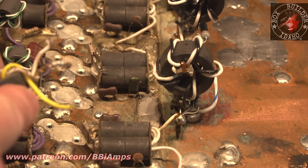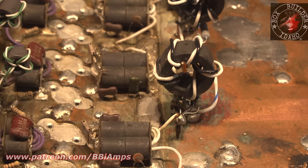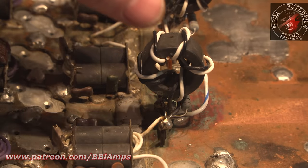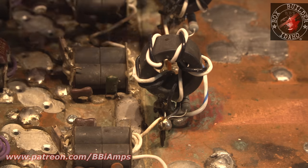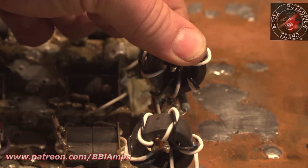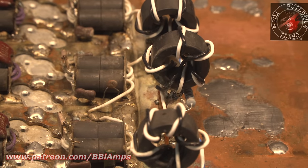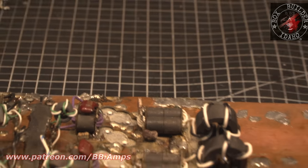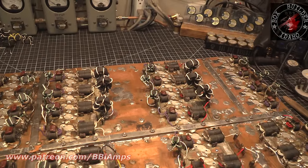It will blow it up. So by them crossing the wires underneath this thing, there's no way that can touch the ferrite. On all these white and black transformers, and that's what this is, watch. Short, short, short, short out, short. Short, short, short. You can literally physically see it touching. Just saying. I got a bunch more desoldering work I got to do over here. I've got to figure out what we're doing on down here, because this here, boys and girls, is a mess.